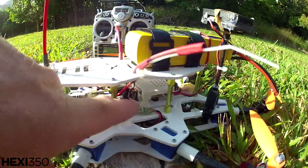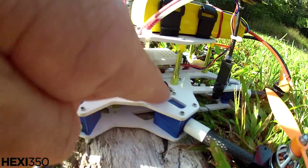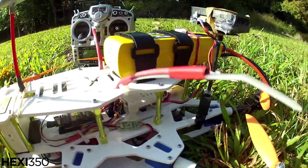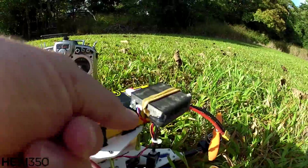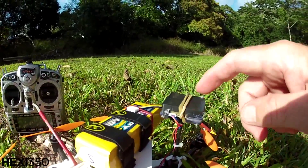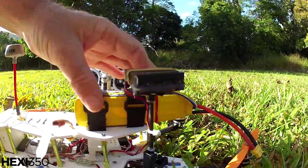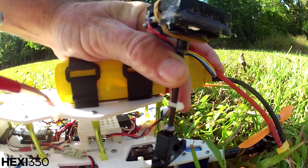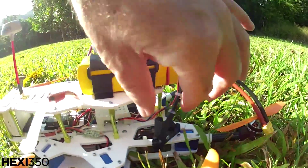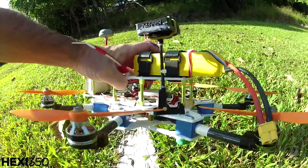The Revo board comes with a built-on mag, but there's just too much interference and I've got six ESCs directly underneath it. I tried the v8 version GPS and it just wouldn't work, so I've got this v9 and it's got an onboard mag, so the mag is away from all the electrical interference. I also got one of these little mounts from Buzz Hobby — they're in Perth — that actually folds down so when the battery's off you can fold it right down, which is pretty good.